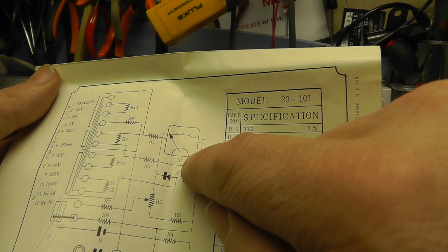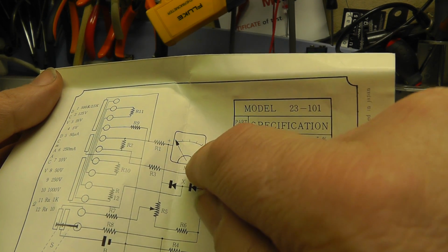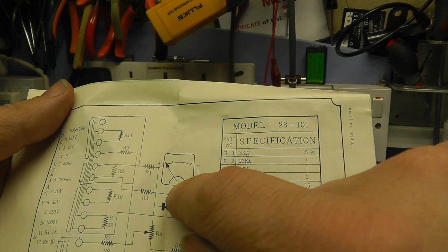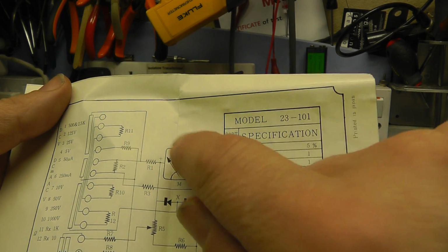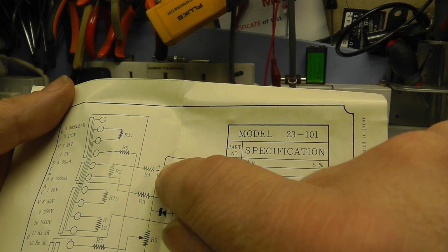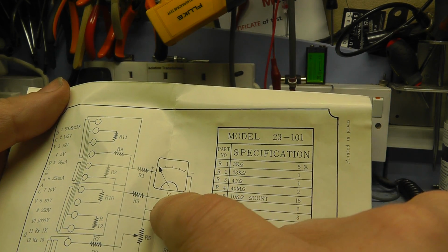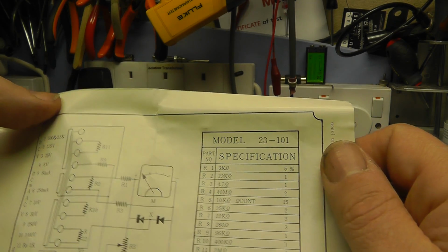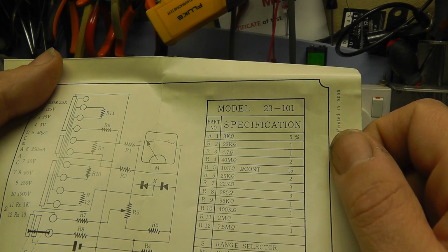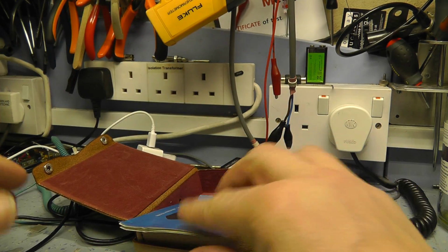What you can do, and I need to confirm this actually, but one thing I was thinking of doing, I don't know if it's going to affect the AC reading, is putting a very low voltage, high value capacitor across the meter. Because the meter is running through a series resistor, it will give you a time constant. So if you apply a high voltage, the meter will come up slowly. It will dissipate a lot of power through the resistor, which is only a 3K, which should be okay, but it will give you a chance to see that the voltage is coming up and it's going to go off the scale pretty quickly, and you know you're overdriving the meter. That basically means the meter's not going to go patwang and just bust the needle, which you've seen before. If you look at listings of second-hand meters that people are trying to sell, you often see that the meter's not started at zero, it's got a bend in it, so that may protect the meter from further damage.